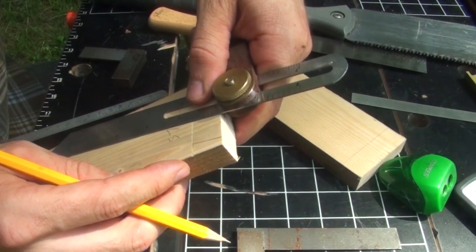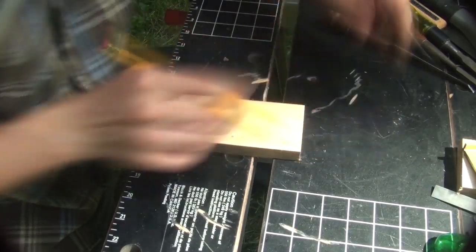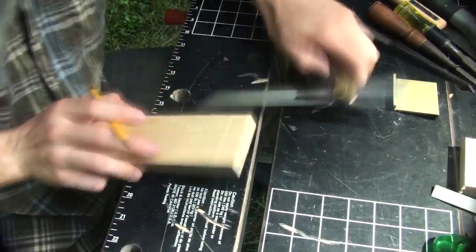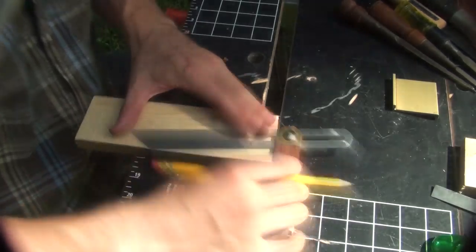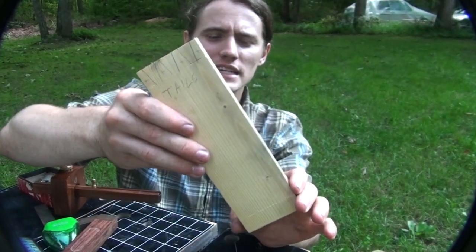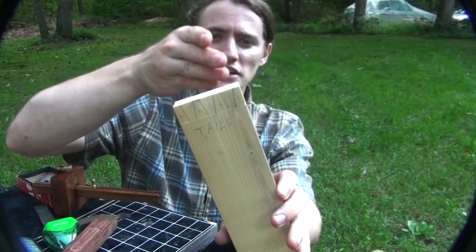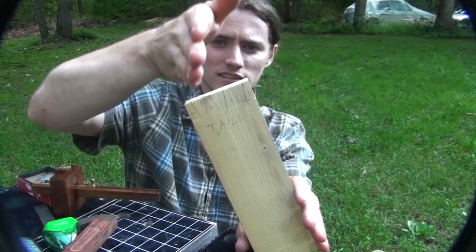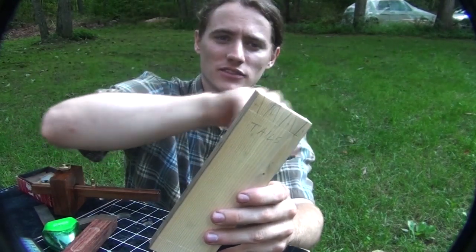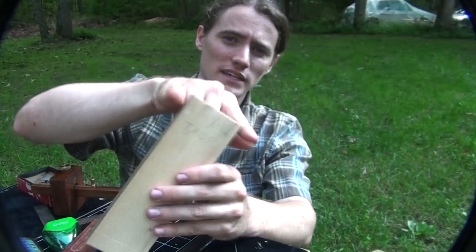From the lines already marked on the end of the board, I've made small tick marks on the face where I need to mark my angles, and you just work your way across flipping your angle tool as you go. It's actually easier to mark all of one angle first, then come back the other way. One method that makes cuts easier is to clamp the board so your drawn lines are vertical — the board will be a little cocked — then make one cut, then the next all the way down, flip it and cut all the other angles. On the dovetail board you'll then turn it on its edge and saw off the ends where the two final pins will socket in.